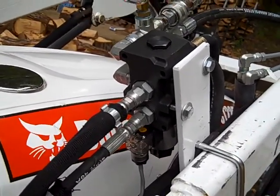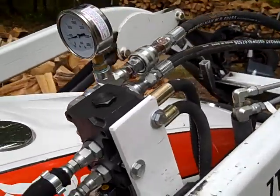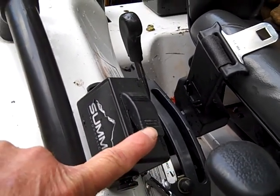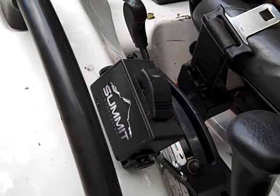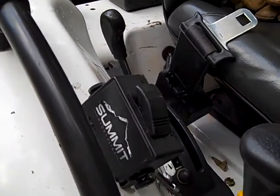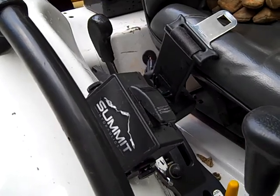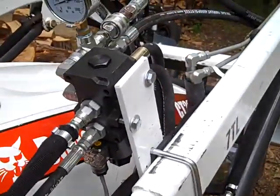It comes with some fittings. You have to watch your voltage — I wanted 12 volts. Most importantly, when you get this, there are options for switches. I wanted a continuous switch so when I go into splitting mode it just stays there — I don't need tilt, so I leave it in one position and go up and split. They have two other options which are momentary contact switches — a dead man switch — but that's not what I wanted. It's a 13-gallon-per-minute valve.